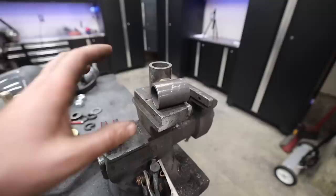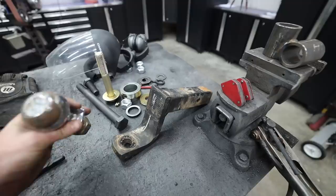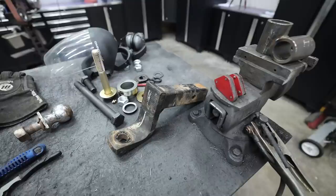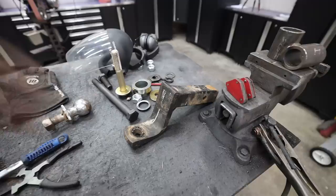I've got something welded together and letting it cool. Let's talk about our game plan. Everything is modeled after just a normal, generic hitch setup — as generic as you're ever going to find. This is rated at 5,000 pounds with a two-inch ball — actually a two and five-sixteenths ball, but usually a two-inch ball goes in there. Two by two, pretty common. You'll even see people haul way more than 5,000 pounds on one of these, but we have a benchmark. If we size things close to this, we should be good for up to 5,000 pounds, and our trailer isn't going to be anything close to that.